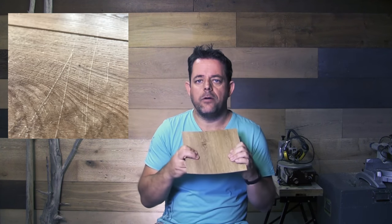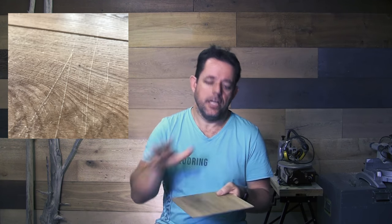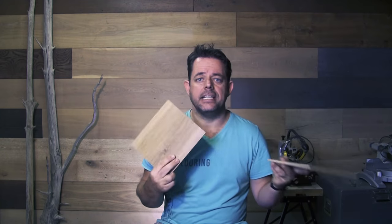The various vinyls, being quite flexible, have had a thin layer of clear plastic sandwiched on the surface with various UV polyurethane lacquers coated on top. Those UV lacquers and scratch resistance lacquers do very well with regards to scratch resistance - I'm not going to knock them - but they're not as strong as a laminate. You're definitely going to need carpet coasters when moving furniture around. Not every product is bulletproof - there are various scales of scratch resistance - and vinyl definitely falls underneath laminate.